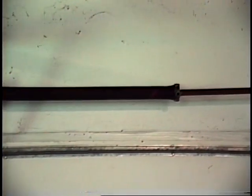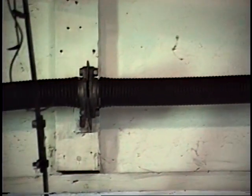There again, one warning though on the torsion spring. Torsion springs do have quite a bit of torque behind them, approximately 350 pounds of torque per spring. And it's just held on there with two set screws. You're loosening them screws and that spring will fly loose. Been quite a few people seriously injured from those. Yep. If you don't know exactly what you're doing, get somebody that's qualified to do it for you. Yeah, torsion springs can really be dangerous.